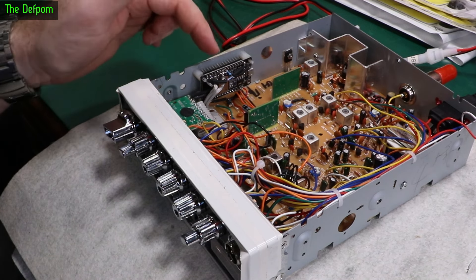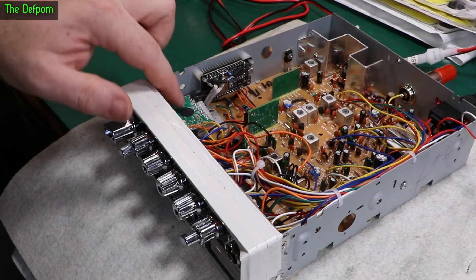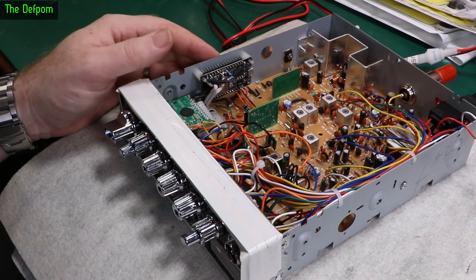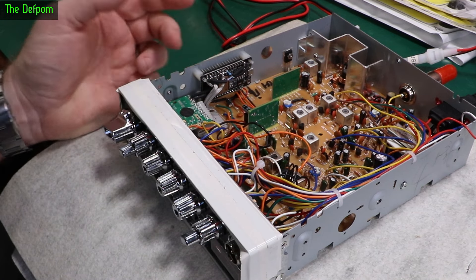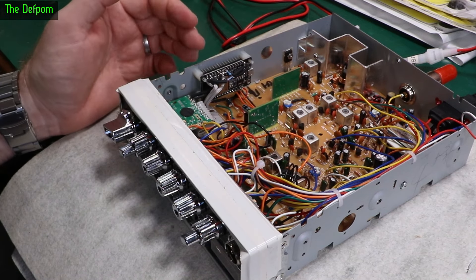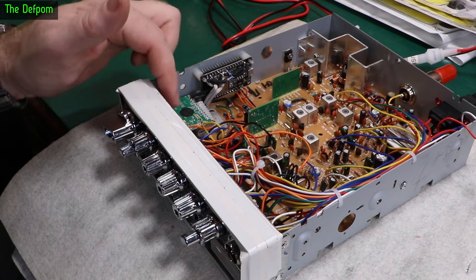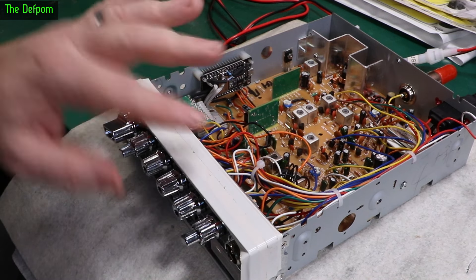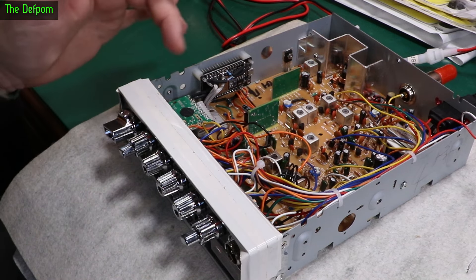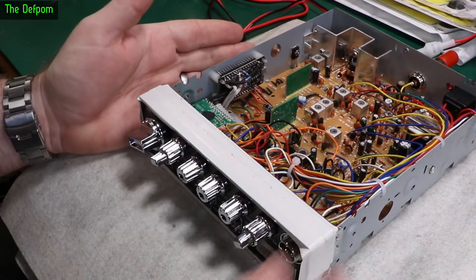For the boot-up sequence, I need a pin from the ESP32 to switch a transistor or relay to control power to the MCU, so it always boots in the right sequence and the data passes through correctly to the SDR IC. The boot-up sequence from the MCU sends data to registers not otherwise written to, so I need to capture that. Once I solve the crashing, data issues, and boot-up sequence, it should be done — transmit and receive work, and I've got two bands.